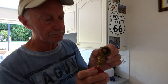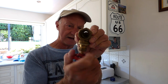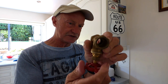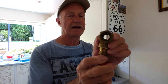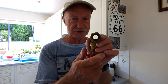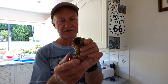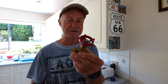Now, a gate valve - as you can see if you look through there - you can see the gate gradually closing as I close the valve. The idea with gate valves is that you get a full flow of pressure; there's no restriction in the pipe flow because it opens the full bore of the pipe. That's one of the reasons they're used instead of a stopcock, which would restrict the pressure. This keeps the pressure from your tank in the loft nice and high to the bathroom.